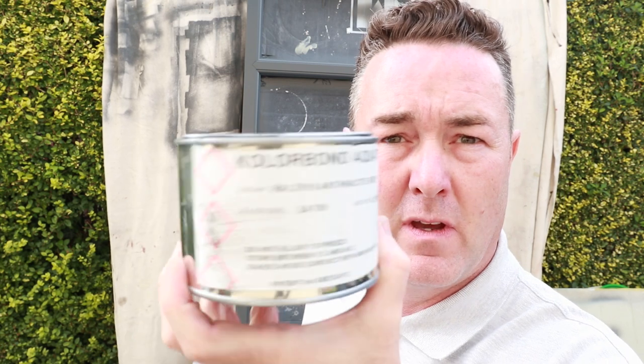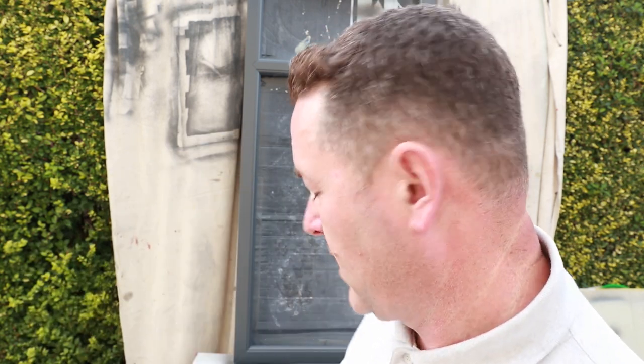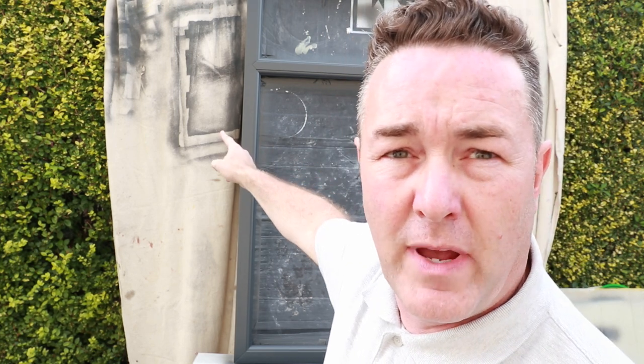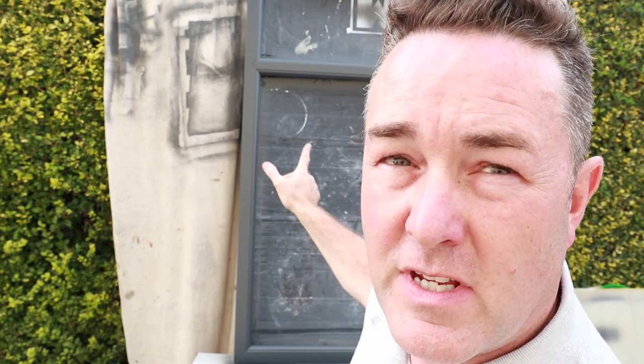Right, let's do a bit of a sum up. Brand new tin, Aquatek from Kolorbond, anthracite colour. You've seen what I've done. Sprayed it with HVLP QT5, brilliant machine, 1.8 needle, all properly cleaned down. You saw that at the beginning of the video. We asked the question, is this the best water-based paint for uPVC windows?